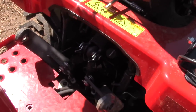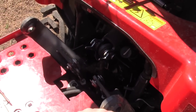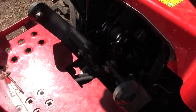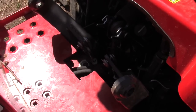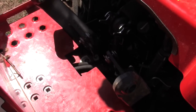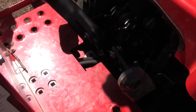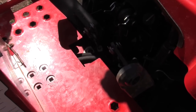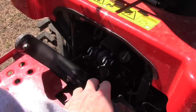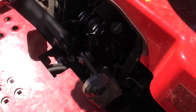The only two real problem areas I've had: after I used the backhoe for a little bit, I started noticing the hydraulic level was getting low. There's actually a hydraulic sight glass — it'll be down here, really close to where your PTO shaft comes out. Just to save you some trouble: the sight glass will actually be completely white if there's no fluid in that area, and when the fluid gets there it'll turn a yellow color. Make sure you have it parked on a flat level surface. The actual fluid fill is right here — it's really accessible, and even more so if you take the backhoe off, though that's not absolutely required.